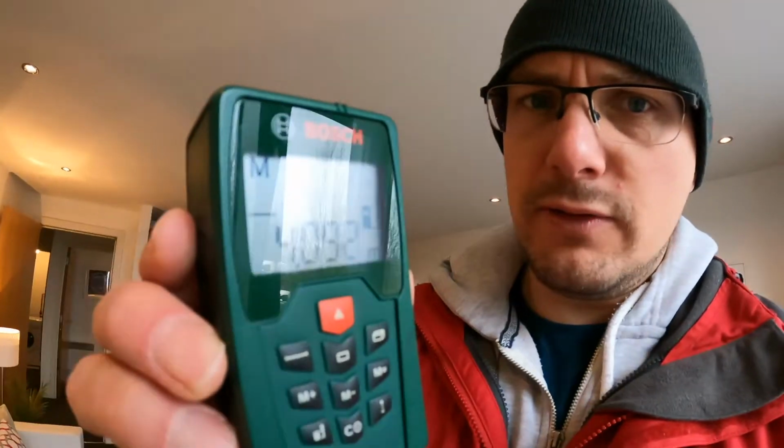So these Matterport scans are fantastic. However, taking accurate measurements from their processed scans isn't always that accurate. And certainly for sales, for legal reasons, you need to have much more accurate, consistent measurements. So for the floor plans, I have a laser pointer measurer, and I do a video recording of me going around the house taking the laser point measurements here. So that, as you can see, is 4 meters. This room is 4 meters, 9 centimeters wide.